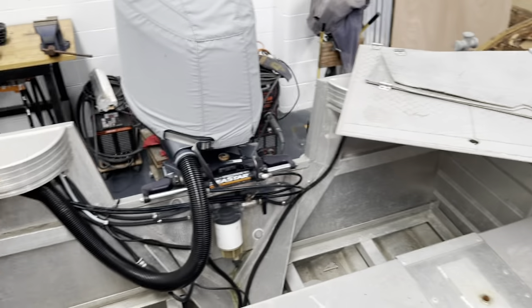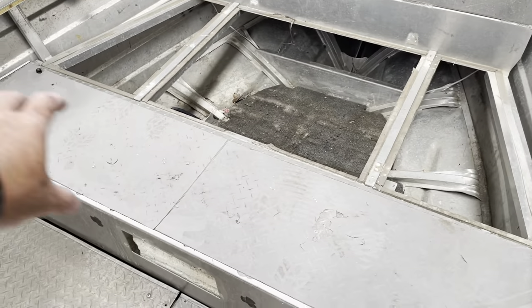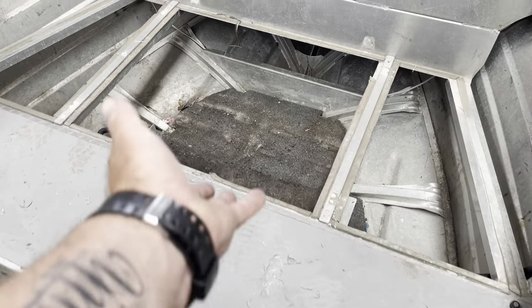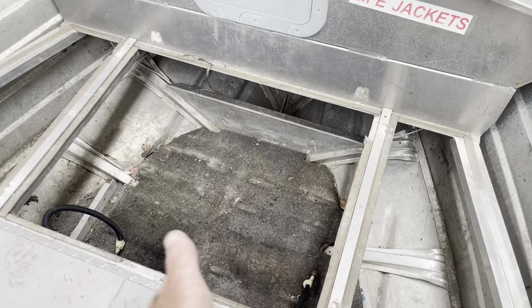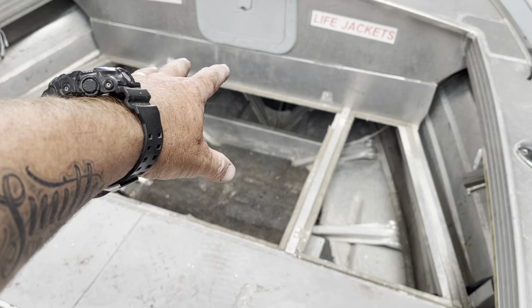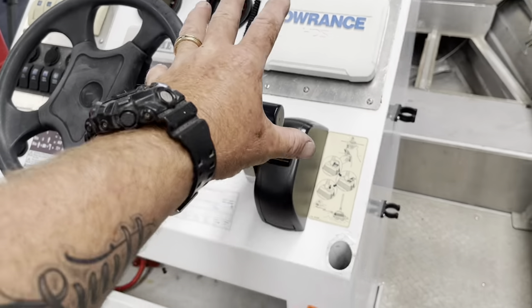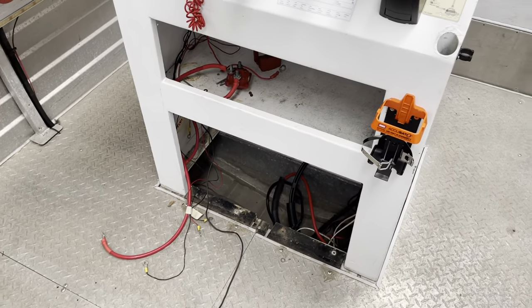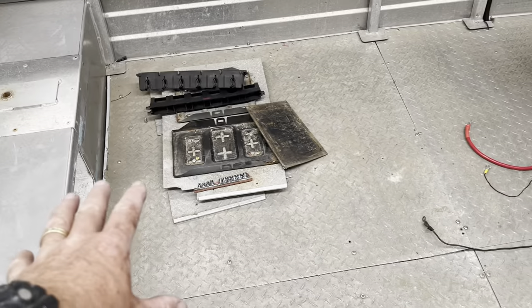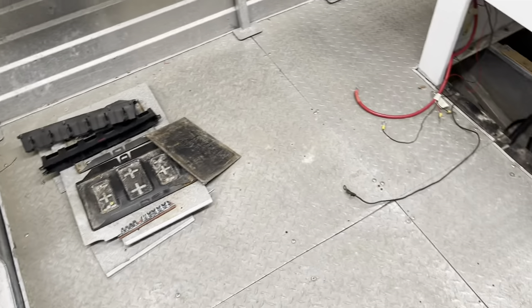The seats have got to come out — they're getting cut out and there's a full rear deck and splash well going in. The old front port seats are coming out, getting cut out with another bulkhead going in so we can still put extra fuel tank storage as required. There is an underfloor tank going in and the console is getting shifted back virtually the width of the console, with a seat back here and a couple of pedestals up the front. Let's rip some floor out.